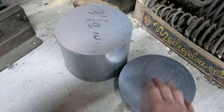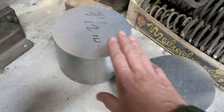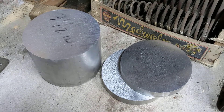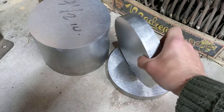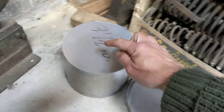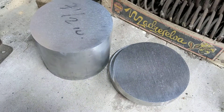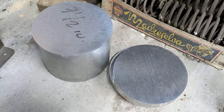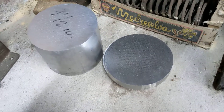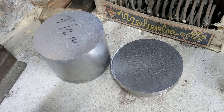Look how exciting is this - there's nothing standard about it. This is a custom one-off gearbox case for a two-speed gearless transmission for my bike. As you can see, at the moment it's three slices of aluminium that I've purchased. We're going to bore this out eccentrically - it won't be a central bore. All of that is on the drawing shown at the start of this video. It's quite a nice grade aluminium - I can't remember exactly what it is off the top of my head but I'll put it in the comments.